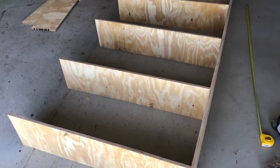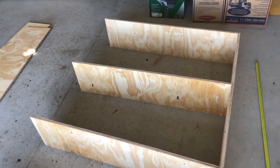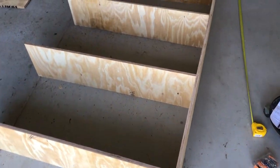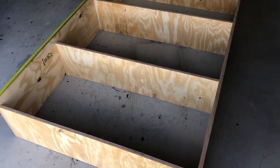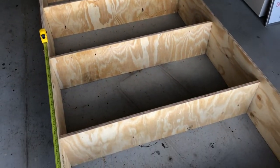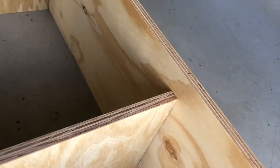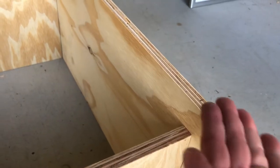I've just finished tacking on the support beams, which will give a good structure once the panel is down on top for people to walk on. I've tacked this in with nails but will probably come back and put some screws in for extra strength. I've finished tacking on both sides — it's a 2400 by 1200 frame with support beams through there. I've left a lip on each side so the panel sheet sitting on top will stop the ball rolling off the edge.